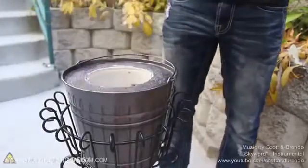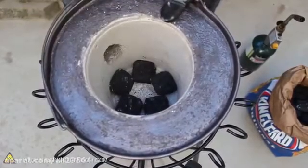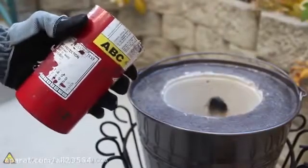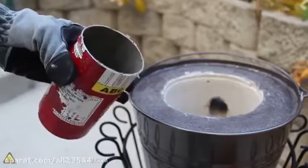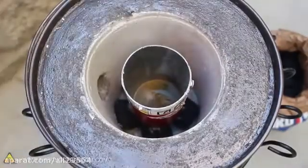Let's start this project with the mini metal foundry we made in another video, and a big bag of charcoal briquettes. These might look like the kind for barbecuing and grilling, and that's because they are. When 5 briquettes are spaced evenly at the bottom, we're ready to add a crucible, like this one I made out of a steel fire extinguisher, and putting the container on a layer of charcoal helps melt the cans faster once we fire it up.